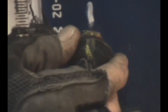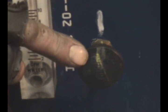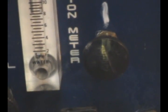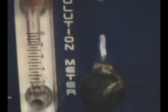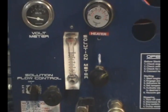You turn this knob to the warm-up position, and while you're setting up, the machine is recycling water through itself, picking up heat from every component, including the oil heat exchanger. Then when you're ready to clean, you turn the manually adjusted orifice to the clean mode.